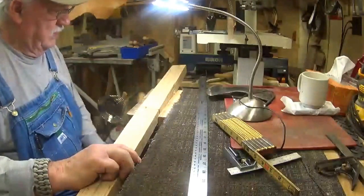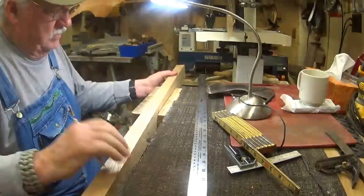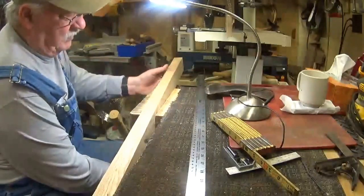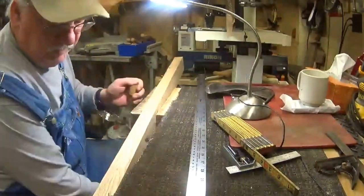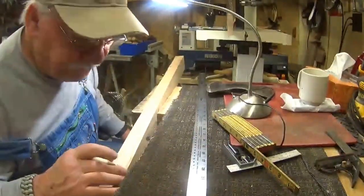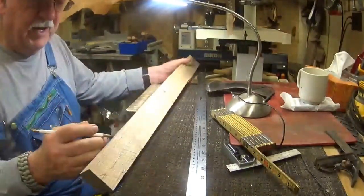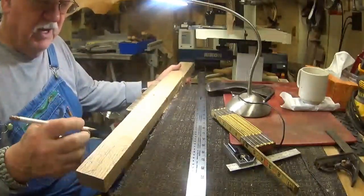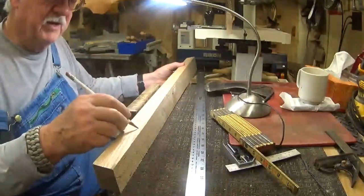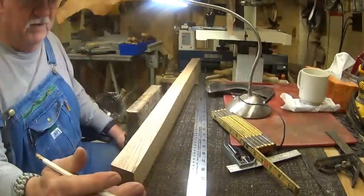I always want to cut it out for the straight edge, so you'll have a straight handle. Well, you do the same thing to the edge after you get this cut out. You can't lay it out yet because you're going to cut that out and it's going to be gone. So after you cut the handle out, then you turn it over and cut however wide you want your handle. It should be about an inch, inch and an eighth, inch and a quarter.